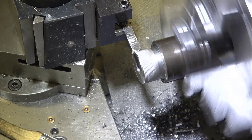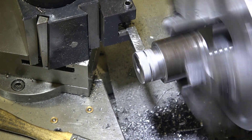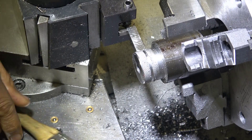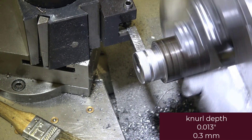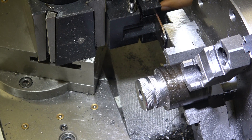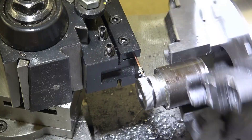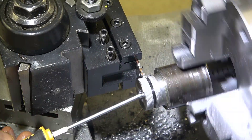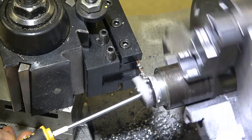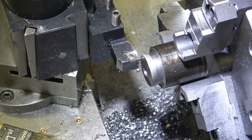Next we'll make room for the second one. Let's see how deep the knurl actually is — the knurl depth was about 13 thou. I'm going to redo the eyeball alignment of the parting tool. Looking straight down, I had misjudged it on the last attempt. I can see the tool is pointed a little bit more towards the tail stock, a hair — so let's take a hair out. I still see a bow, and it's actually worse — about 35 thou this time. I'll keep working on trying to get the alignment right.